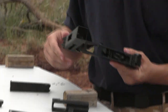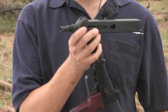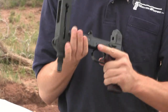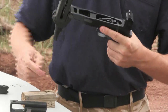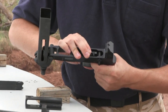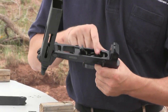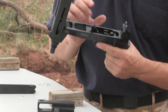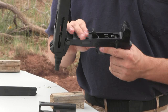That's all there is to the upper — you've got a very short little barrel. They did come threaded for a suppressor, same thread as a MAC-10 suppressor. The fire control mechanism is actually kind of interesting in that it is almost a complete perfect copy of the AK fire mechanism. We have a spring-loaded sear and then the front hooks the hammer. AK parts wouldn't actually interchange into this, but the design is identical.